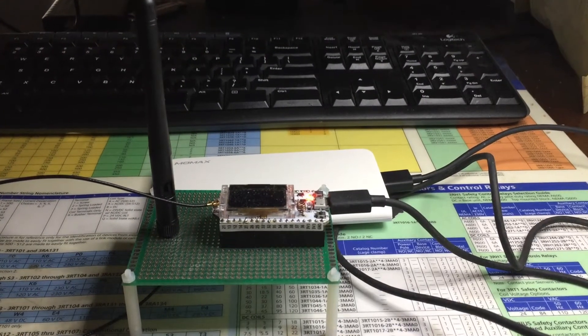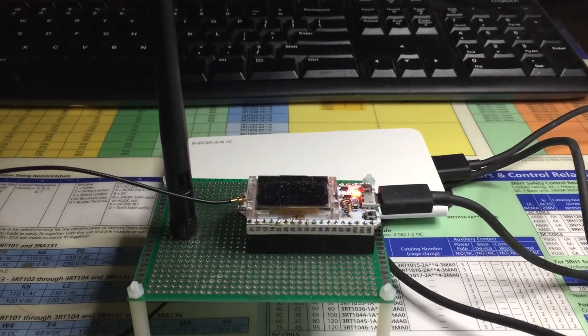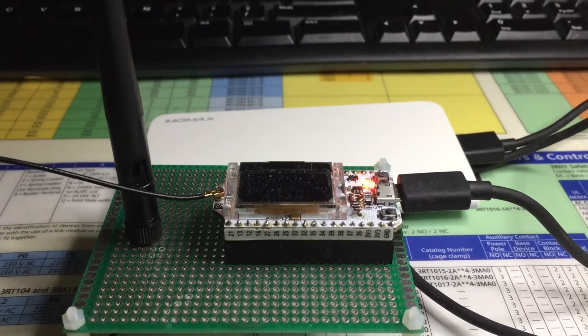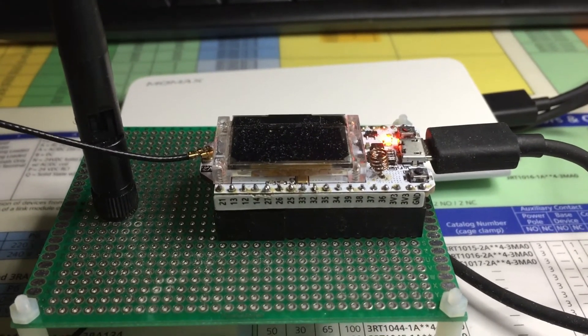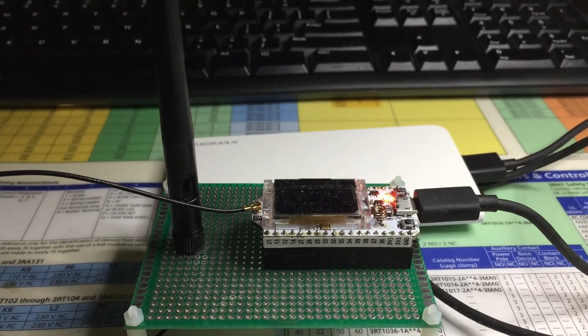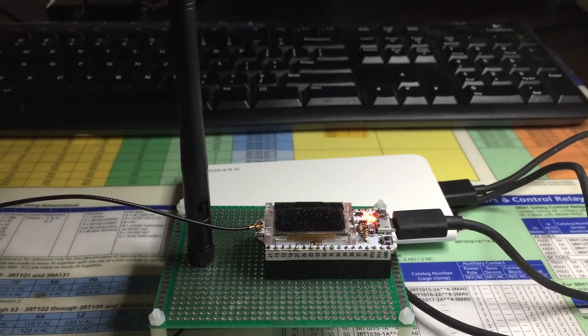All the ESP32s are Wi-Fi compatible. You can see the coiled Wi-Fi antenna on this particular processor along with battery packs supplying the power. This has allowed me to go to the World Wide Web. Using the MQTT protocol over Amazon Web Services, I subscribe and publish messages to another remote ESP32, which I'll show you in a few minutes.